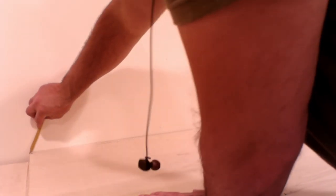And this is the method I'm talking about. You put the pencil along the wall, and then you just draw a line, and then there's going to be some left. You're going to have to use your circular saw or a jigsaw to cut this out. I know some people who even use table saws, and I think they're crazy for doing it because if it kicks, oof. Never try to save wood that's kicked. Just get out of Dodge. But yeah, that's why I avoid that.